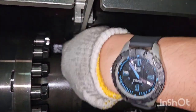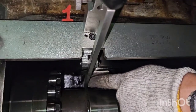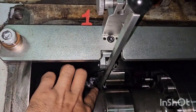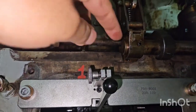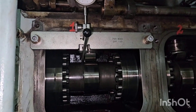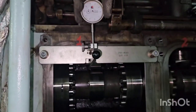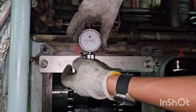You can see this is already touching the bottom part of the roller guide. One pointer touches the bottom part of the roller guide, and at that position we will put the dial gauge. The dial gauge will be put in under compression, because it will give us the measurement when we rotate the camshaft.